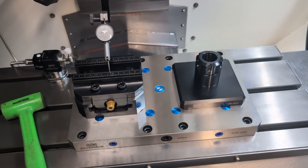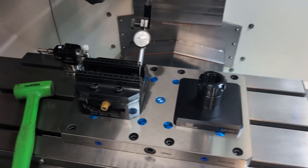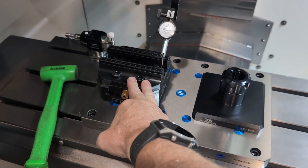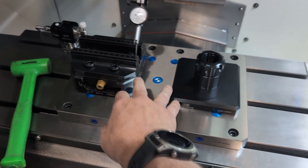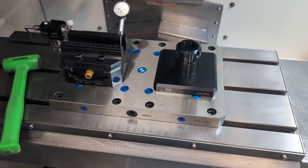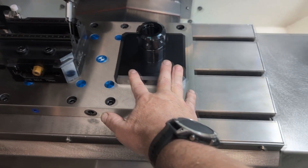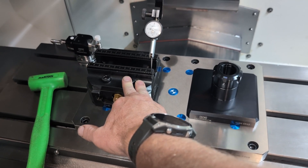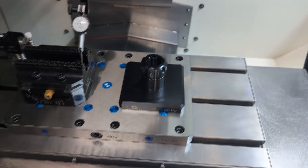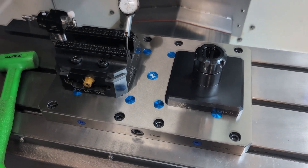I have got this trammed in and running true, at least this vise here. I started by tramming in the base, then threw the vise on and compared the vise to see if it was still trammed in on the side position, the middle, and then the right. Each time I moved the vise, I got a different result. So then I decided to throw in this collet vise — this is how I'm going to be running it. I'll be running my roughing off here and end up with a one inch diameter that goes in to finish my final operation. Once I put in both, it was out of tram.